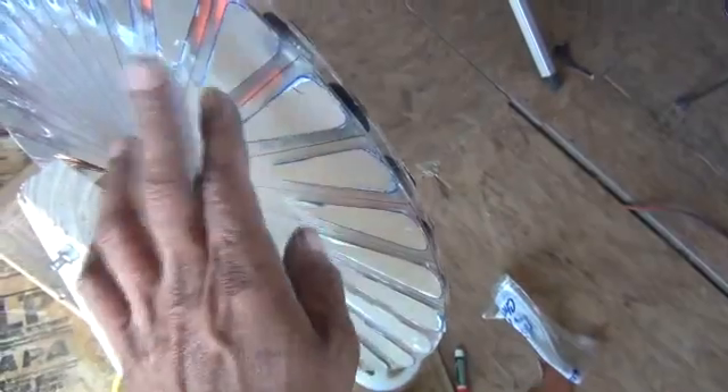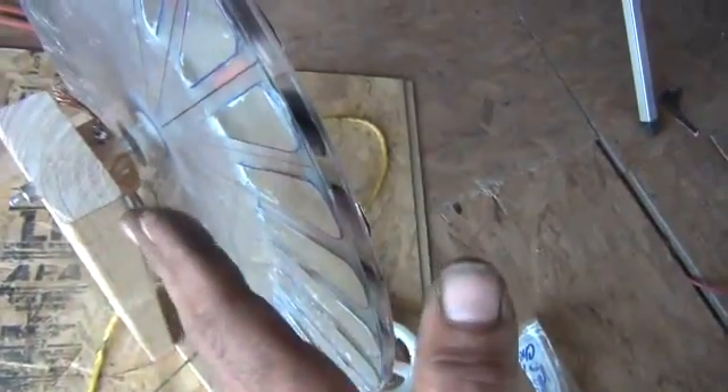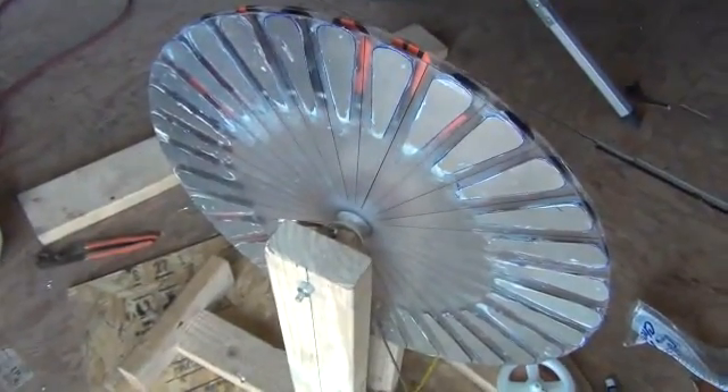The aluminum will be exposed out the back side, then I'll laminate a thin eighth-inch piece of plexiglass over the back of the half-inch piece — so in the end we'll just have two eighth-inch dielectric layers between the two striker plates on either side. We're going to hook that large four-footer up to a giant windmill to get nice cascading electrostatic sparks from a wind-powered Wimshurst electrostatic generator, and I'll show how to use that for some neat science experiments.